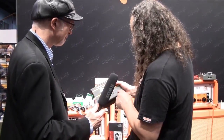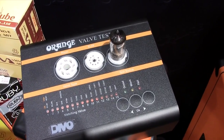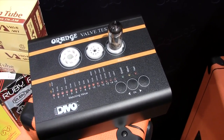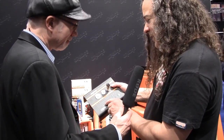You just plug in the tube, turn it on, and cycle through the appropriate tube type using the toggles. About a minute and a half later on a preamp tube, it gives you a number. These tubes have a left and a right side — if they're perfectly balanced, it's one solid number. If the left side is a little less gainy, you'll see it flashing. Whichever side has lesser gain is going to flash.